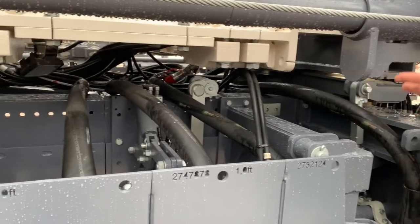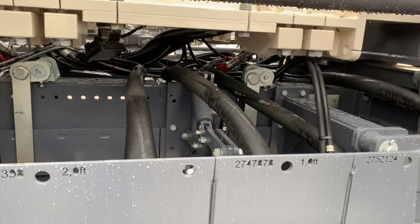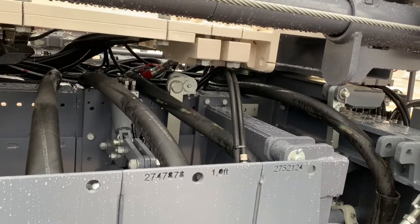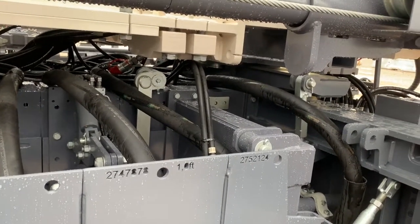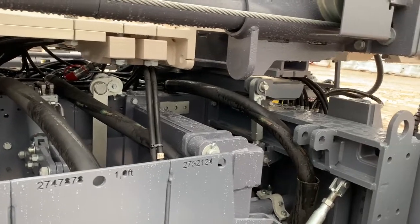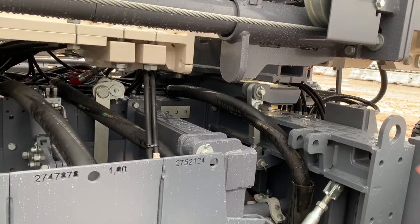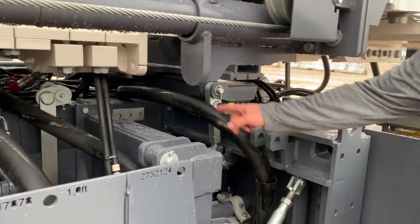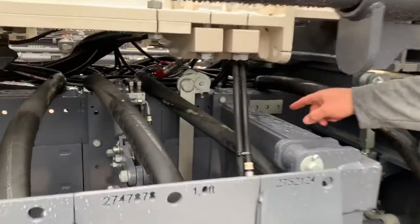If you had a closed-off metering gate, you would have a lot of excess grout in the grout box. If you didn't pay attention to your concrete height inside there, you could end up with an edge that was more grout than aggregate. So the open-ended design helps maintain proper aggregate content at the edge.